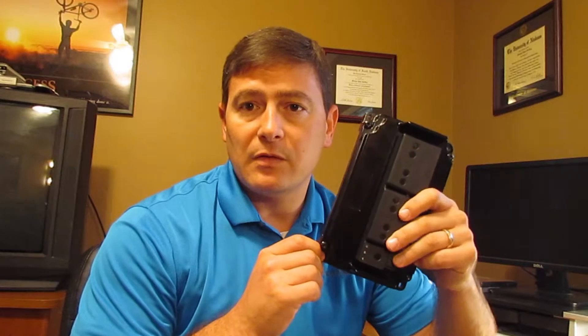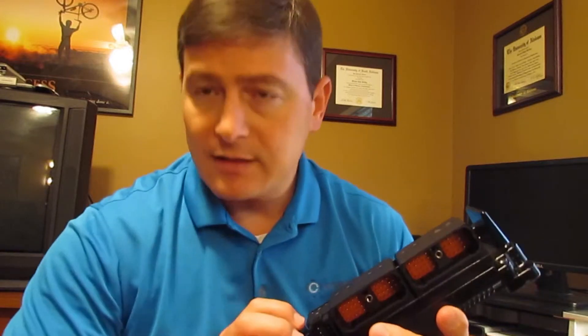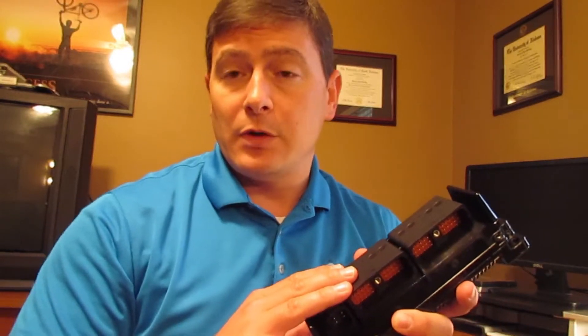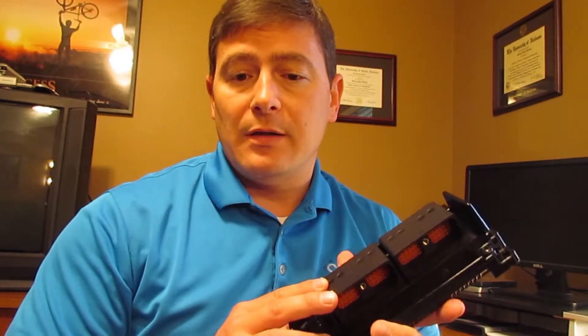I'll post another video that details some information on the ProFX software package. Another point I'd like to make about this unit: it has onboard voltage supply for your sensors or joysticks. There are two pins that are configurable for either 5 or 10 volts, so that's a nice feature that a lot of controllers don't have.